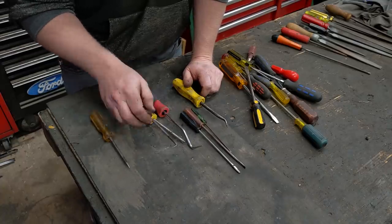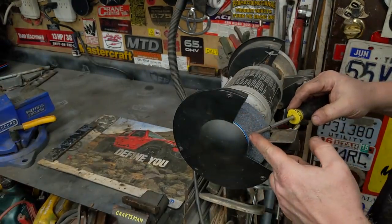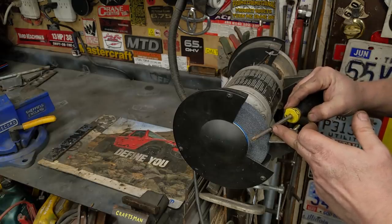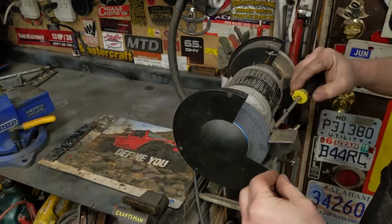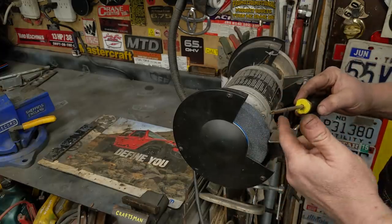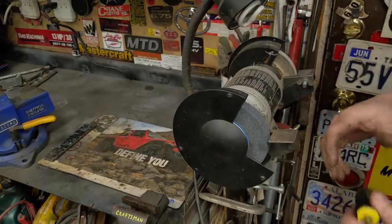The shank on this is about a quarter inch. For something this fat, I need to taper it down at least two inches to get a nice even taper on it. I'm going to use my bench grinder here — if it was skinnier you wouldn't have to taper as far — but we're just going to go for it and taper it down.